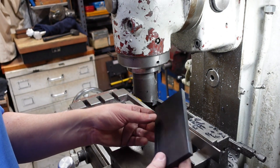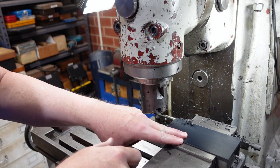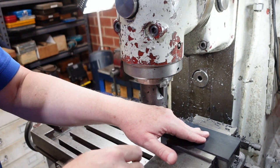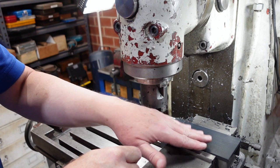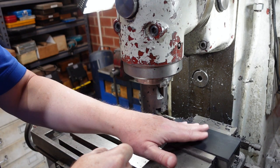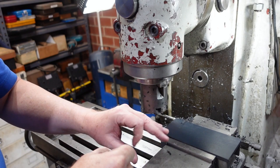For clamping things like that you do need to deburr, so that's all good. Before leaving the fascinating subject of making thick things thin — just to point out that this plastic has been made with a thermal process. It's been molten, squeezed through some rolls or an injection slit to give it its shape and then cooled down. So you're going to have a lot of built-in stress here. This is why it's important to take material off both sides. I did two and a half mil on one side, I've now flipped it over and taken the same off the other side. There's a slight dish, so I'll have to bear that in mind, but there's not much point in getting a nice thick bit of plastic and milling it down all on one side because what will happen is it'll just banana.